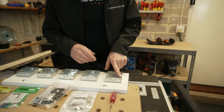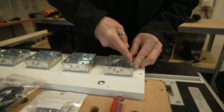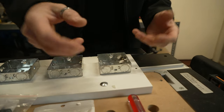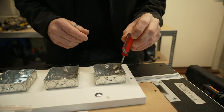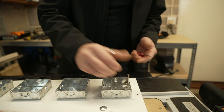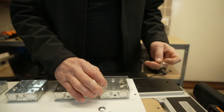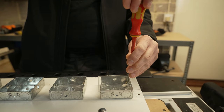Say you've just had your walls re-plastered - muck invariably always gets in the back boxes. As you can see I've just chucked some filler in just to simulate that. You've got to scrape what you can out of the way first, but invariably it just doesn't want to come out too easily, and even when you do there's going to be gunk all in the thread. So by taking your re-threading tool, quite literally just put it in the hole and screw it in to clean all that rubbish out, which then allows you to put your screw back in. Just to show how that really works, I've cut some little pieces of perspex for the camera so you can see what's going on - it just winds straight in, no problem whatsoever.